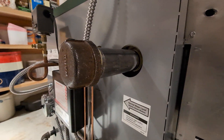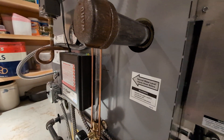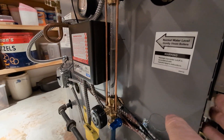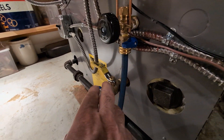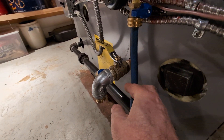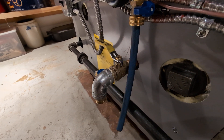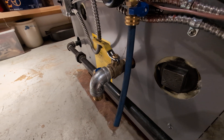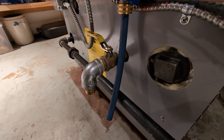This is their skim tapping, although nowadays it doesn't seem like they have as much goo in these boilers as they used to, so the skim tapping is kind of an afterthought. This is where you're supposed to put the boiler drain, so we put our full-port boiler drain on here — that gets the water and any dirt out very quickly for a good flush.